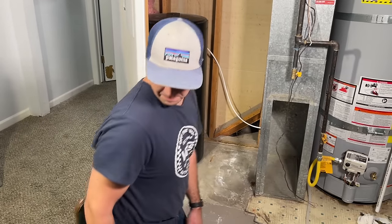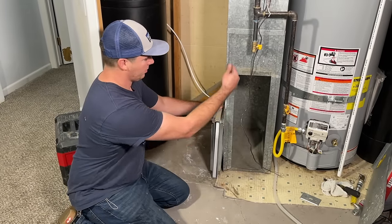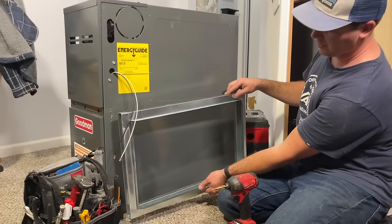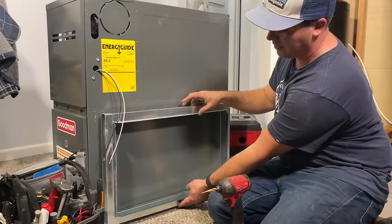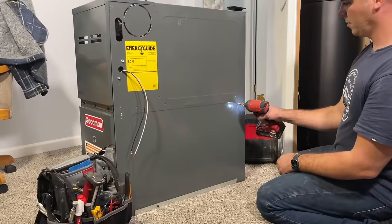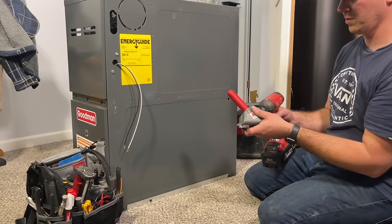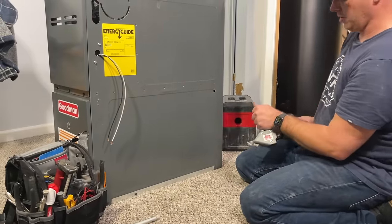What we need to do is open up the side and we'll have this filter rack — this will be a lot easier than using the other system. We'll need to adjust this and build a little piece of sheet metal. This is our filter rack and this is the cutout on the side of our furnace — as you can see, it's the same exact dimensions: 16 by 25. We're going to start by removing this whole piece right here — we'll poke a hole in the corner to give us a starting point for our turbo shears. These are really cool, about $50, and they make cutting out stuff like this very easy.